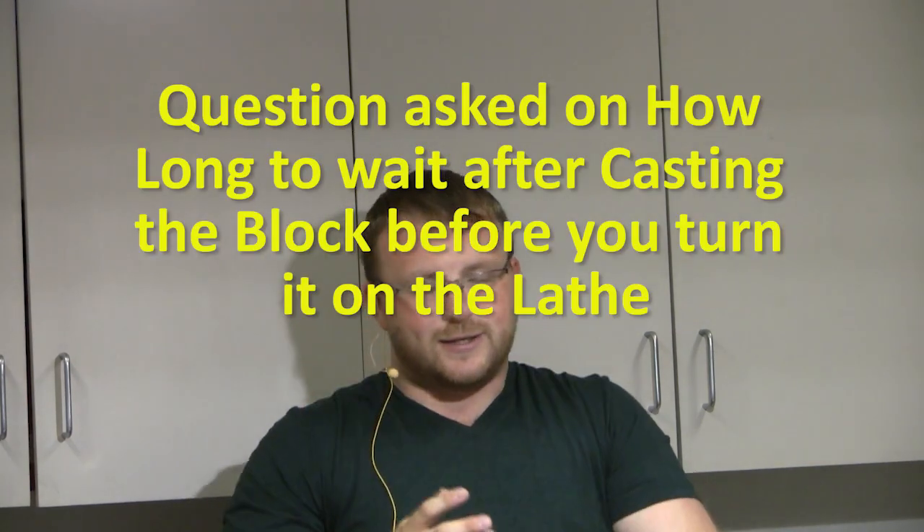12,000 micro-mesh. You technically could immediately turn it, but I don't recommend it. With Alumilite, I recommend waiting three to five days. You can cut the block up and turn it in two hours — that's no problem — but where you'll really notice it is during the polishing. You're not going to get a really good polish because it hasn't fully cured yet. It does take a week to fully cure. Normally it's not a concern because you're buying somebody else's blanks — those are already fully cured. As soon as the block cools down you can cut it up, but wait at least three days to turn.